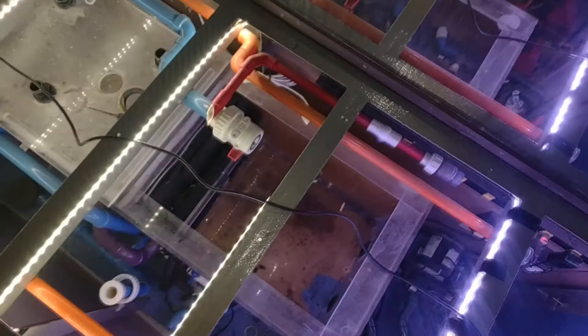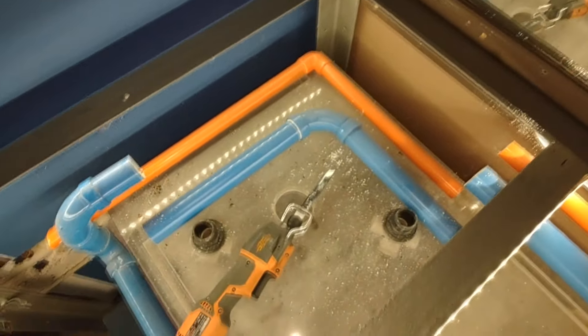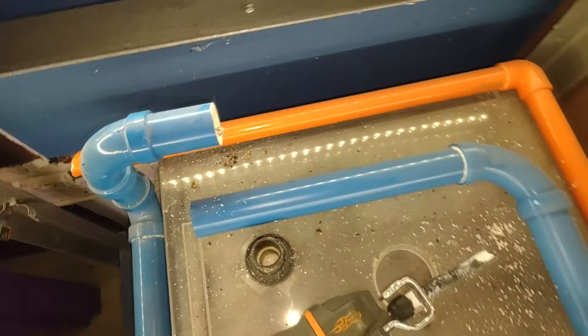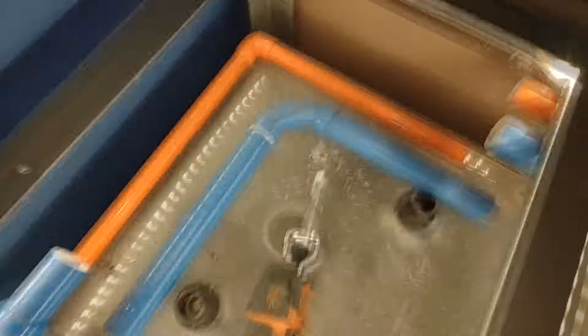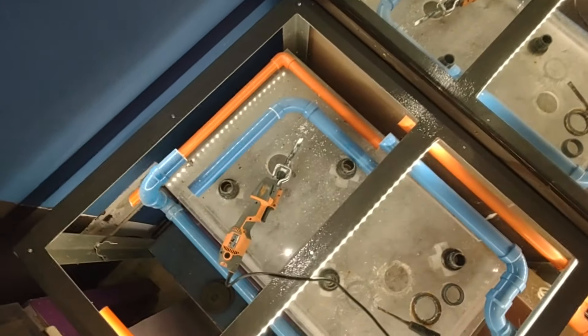So just a quick update - as you can see, I've got all the lights put on. I had to silicone the back of those guys - anything else I tried using in the past just did not work, so I just broke out some silicone in the caulk gun. Now you can see they're holding pretty good. I've also broken out the saw here - I went ahead and cut the orange pipe and the blue pipe, so those are out of our way. Not quite sure where we're going to go with it in the future. More likely you're probably going to see a coupling there in time, and the same over here on that return line which goes back to the closed loop. The blue was the supply - probably double couplings and you're going to reroute that in time. Go ahead and get those out of the way, vacuum this all up, and it's time to put the wood on. We've got to get this tank on here.